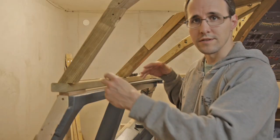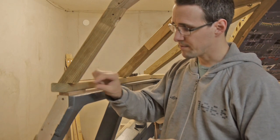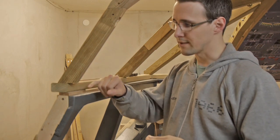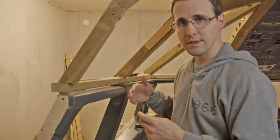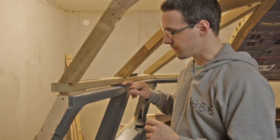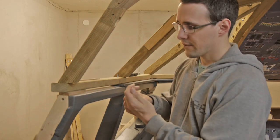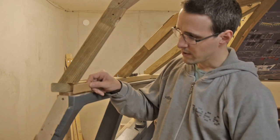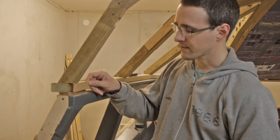To start closing this main ceiling here, I will have to cover this small gap between the frame coverage and the start of the ceiling frame here. And to do this, I will first extend this gray piece of MDF until here, and then close the gap with a small stripe of this HDF plate.